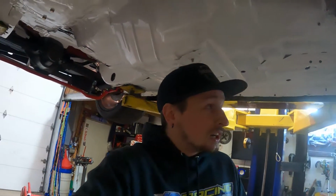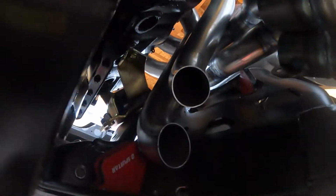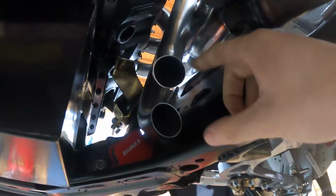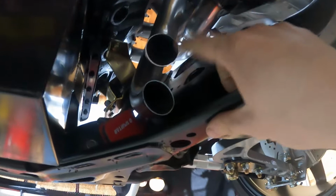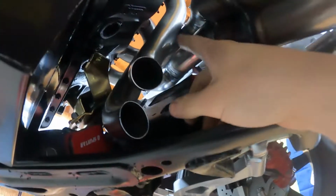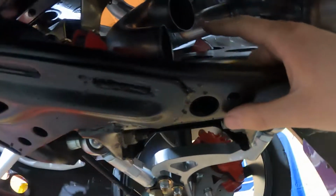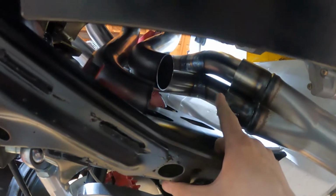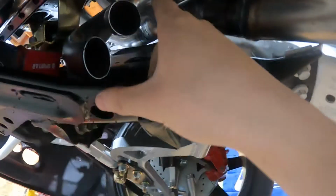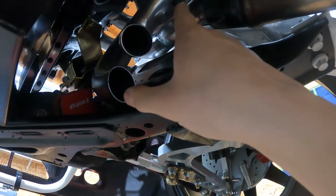Saturday morning, we're about maybe 20 minutes into work, and we're gonna have an interesting one. So this is where the stock beginnings, I say stock, whatever, the header beginnings, the beginning of the headers for the long tube, doing the 15 inches, and then I cut this one at 19 because I knew it needed to drop below. End up in a really interesting spot. So we're gonna have to get pretty creative on this and try and make up that space to match the other side.